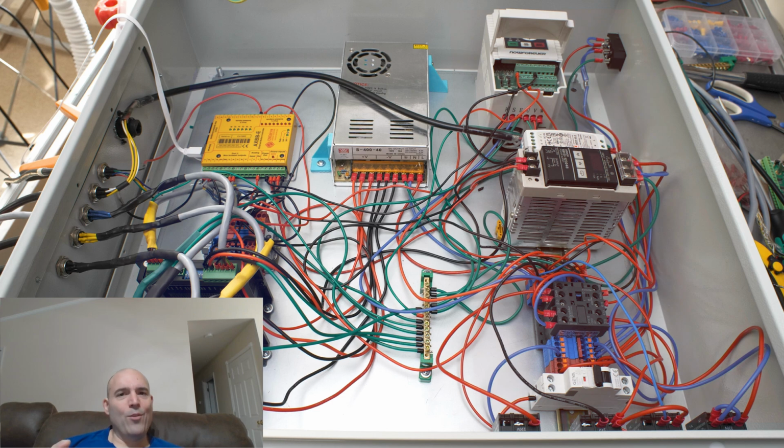Here's where being a novice, creating a beginner's guide as a sort of an authority can get into sketchy territory. How many of his audience members will implement putting each of their voltages on each side of their electronics enclosure thinking this is going to mitigate their EMI? I want you to think logically of how many people in the forums have had unstable robots, and if all they had to do was mount all of their electronics that are high voltage on one side and lower voltage on the other side, it would actually do something. If that was the case, we would see no problems. The fact of the matter is this: if this actually worked, like I said, you'd have no problems in the industry. This would be an easy correction.